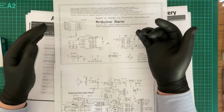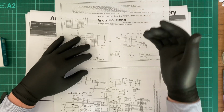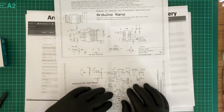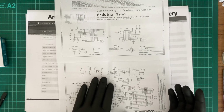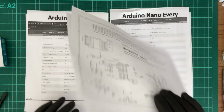Yeah, to put something like this onto your own board, it doesn't really require that much. And especially with the Uno, a lot of this, if you're not connecting to USB, you don't need this whole part. You can just pop that away. So really, it's just the reset line, the power lines, the crystal oscillator, and a couple of capacitors. That's it. Hook up whatever you need, and you're done after you've supplied an appropriate amount of power. So they're not that difficult.